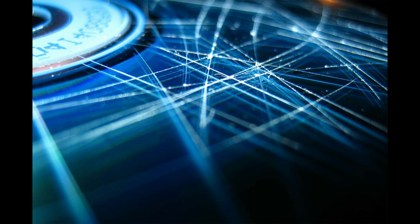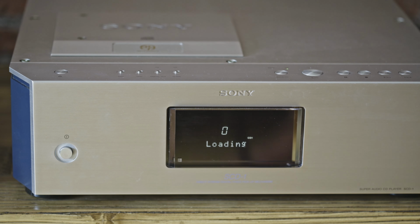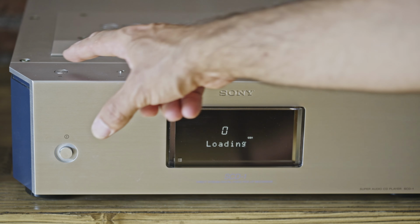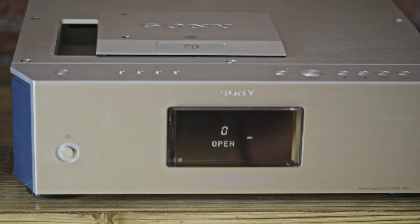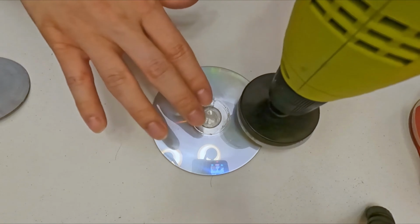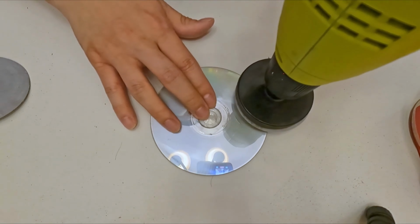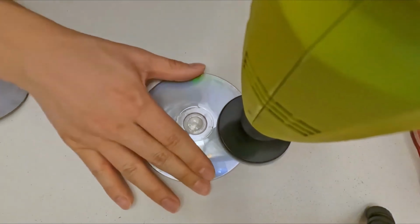CD, on the other hand, is usually quite resistant to scratches, up to some point when it's not. When a CD player can't read some portion of a CD, it uses error correction to sort of fix what's not there. Again, it works up to some point. If there's too much missing data, you won't hear the track in lower quality as with the vinyl record, but rather nonsense generated by the CD player. To get rid of the scratches, CDs can be polished, if the scratches are not too deep, of course. From a technical standpoint, a CD is just far superior to a vinyl record, that is.